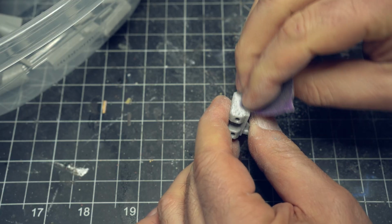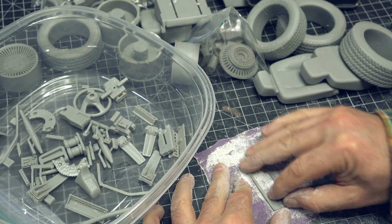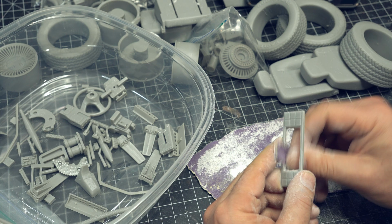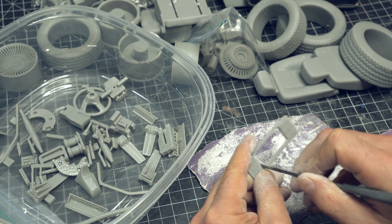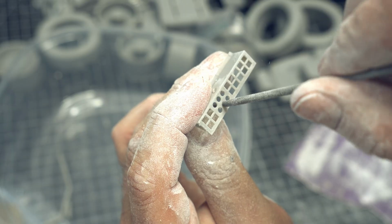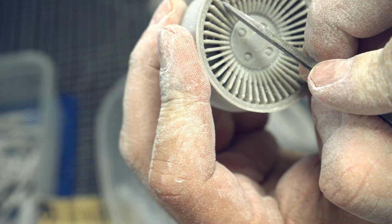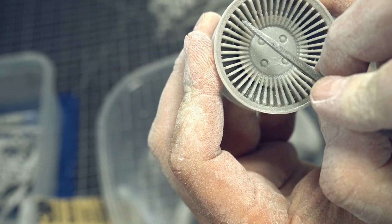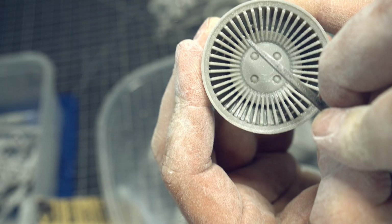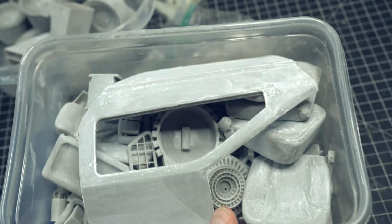A lot of the stuff I didn't really need to sand again because the resin really makes it a nice smooth print. But you can see I'm using sandpaper, I'm using files, I'm using anything I need to get in there and clear things out. These little cylindrical rasps work great. I went in there and cleared all that out. The pointy ones help with these types of areas, and you really want to get in there and make this thing as smooth as you can, but you can see when you're done, it's very dusty. You need to wash that.